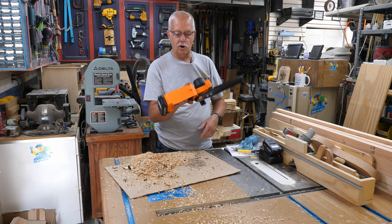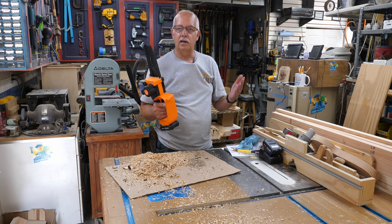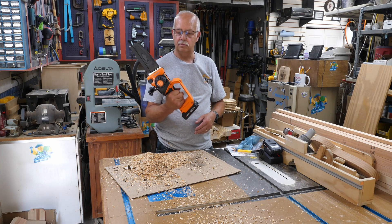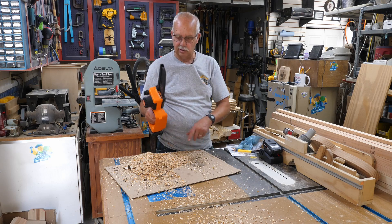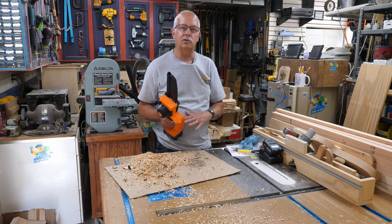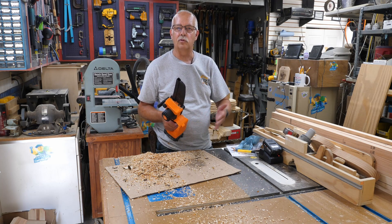There's a demonstration of this OLMLMO — you can pronounce it any way you want. A nice little chainsaw. Performed really well, even with a battery that was not fully charged. I originally intended on doing some of this stuff outdoors with some tree pruning we needed to do in what I call the Back 40, but it is just blazing hot today. I worked up a sweat just going out and cutting that one little piece off. If you'd like to get one of these, there'll be a link in the description — you can get them on Amazon. It appears to be very durable and very well built. Apple is not exactly a soft thing to cut, and it did an excellent job. I did have to adjust the chain because, again, when you have a new chain — no matter what brand — after a few cuts it will stretch, and you'll need to tighten it up again. Keep checking your chain, because over time they all stretch.